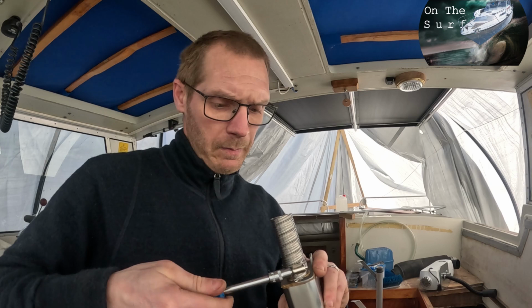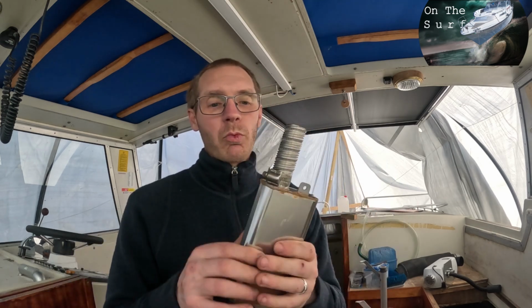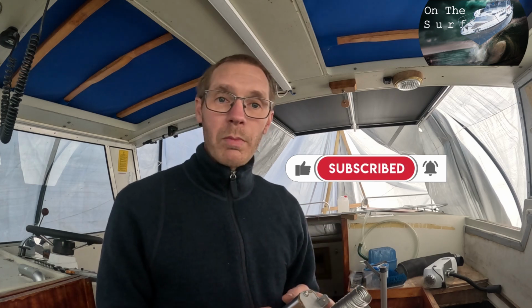Hose clamp. So there's one part. So let's see if we can get this onto the heater. And yeah, for this better exhaust pipe you need better hose clamps than the ones that come with it. I have destroyed 3, then it didn't grab, and I replaced it with a better stainless steel one, and it grabbed directly. So need to go and buy more hose clamps. So be back in a bit.